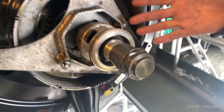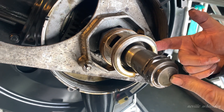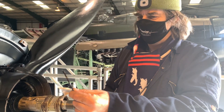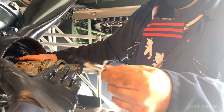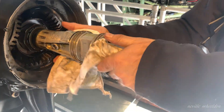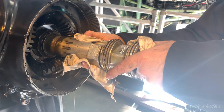We are now going to remove the propeller oil distribution valve. Points to note when you remove yours at home — it is a left-hand thread. So here is the illustrious pit as removed earlier, handed to Mr. Bradley. Removal of the distribution valve, remembering it's a left-hand thread, so it looks like we are tightening it up.